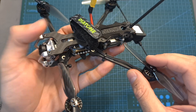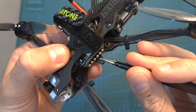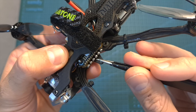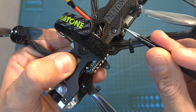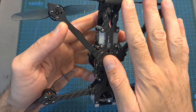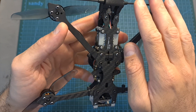The quality of the carbon fiber parts and the electronics is great, except the GPS unit which took forever to get a GPS lock. The motor wires are nicely soldered to the 4-in-1 ESC, and it's excellent that the flight controller features 4 full UART ports and a 9V BEC to power the Caddx Vista. However, the Roma F4LR doesn't come with a self-powered buzzer, so if you're going to use it for long-range flights, I highly recommend adding one.